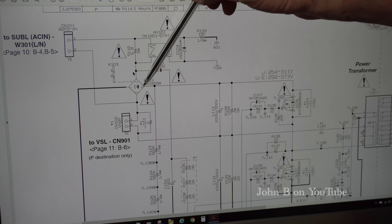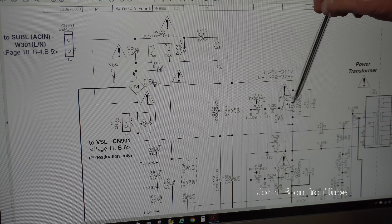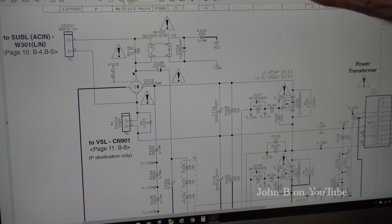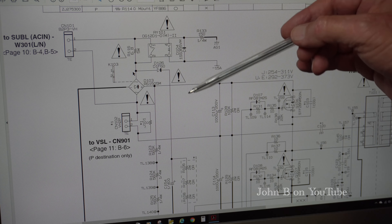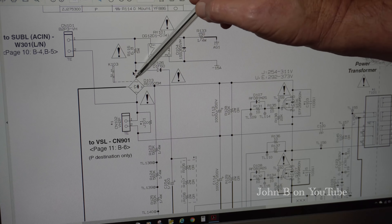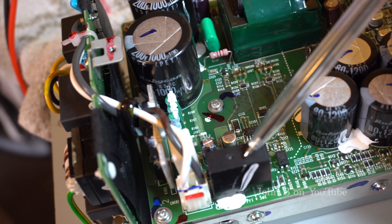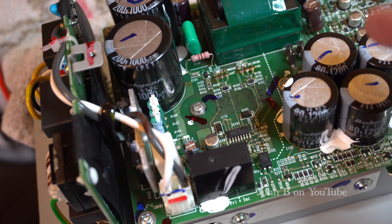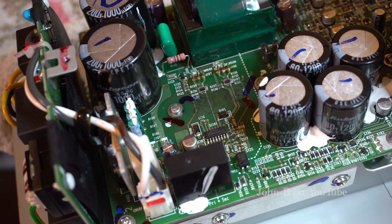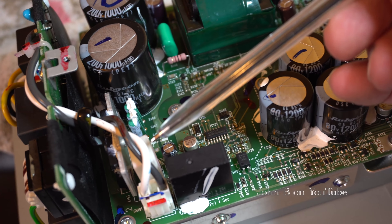So I'm wondering — most likely cause. When those FETs went short circuit, it would take out presumably this resistor — 5 watt, 6.8 ohms. I guess I'll have to undo the board and test the continuity of that. I can't get to the rectifier to test the AC here, so I'll pull the board apart and check this. And here is that 5 watt resistor. Probably a flame-proof one. And that's the relay — and I don't hear this clicking. Obviously the switch mode power supply isn't running, so we've got no negative 15 volts to pull this in.